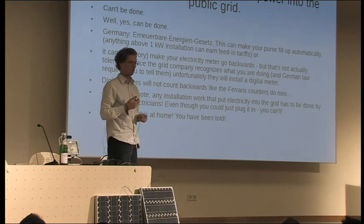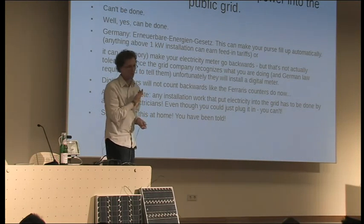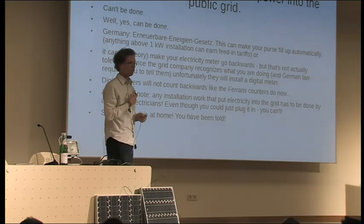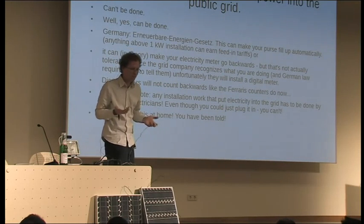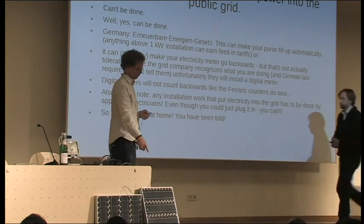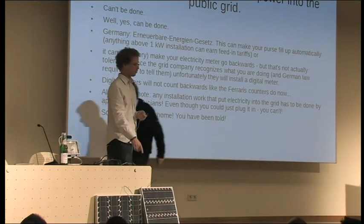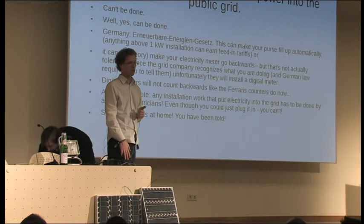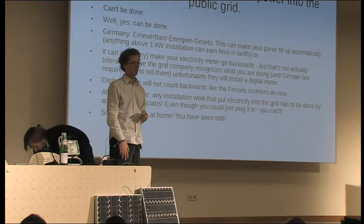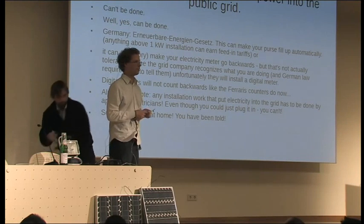Make very sure you include this in your own circuits. There's a good reason for that. If your power grid at your place goes down, which happens, and the sun is shining, you, with your own power parts, are delivering electricity into a grid that your local technician is trying to repair. Don't fry him. Really don't. He'll die.